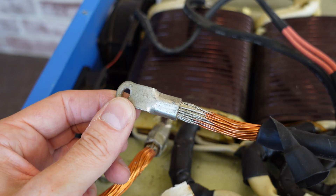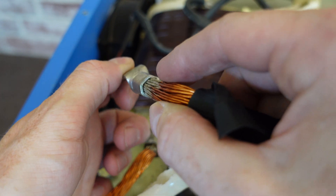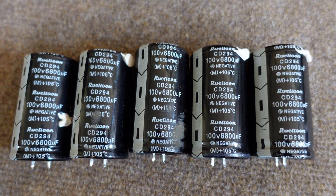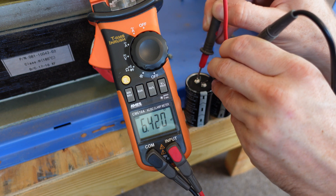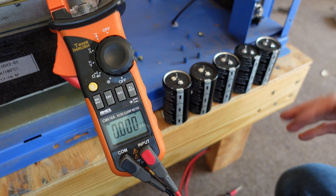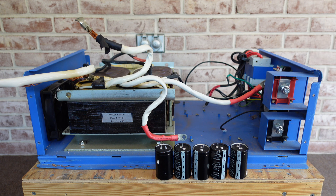Here's how the other end is terminated — there's quite a bit of solder going up the conductor, and there's still a large gap around the conductor where it was crimped. These capacitors are all the same: part number CD294, 100 volt, 6,800 microfarad. I'm reading 6,400, 6,400, 6,400, 6,400 microfarads on most of them, though one looks a bit odd at 660. This inverter is old and there are a number of things either wrong or that I don't like about it. Hopefully that was of some interest — hit the like button, leave questions or comments, and onward to bigger and better things. Thanks for watching.